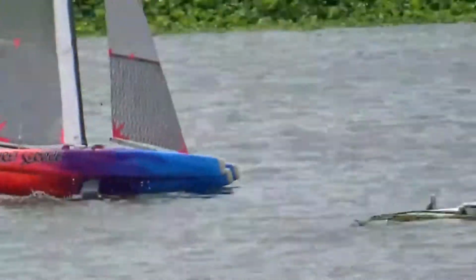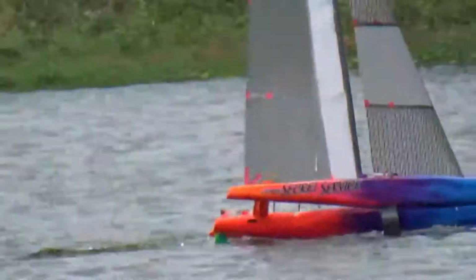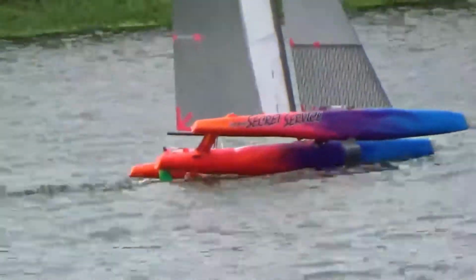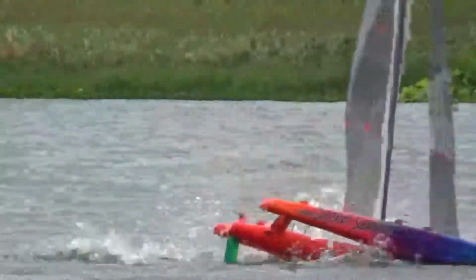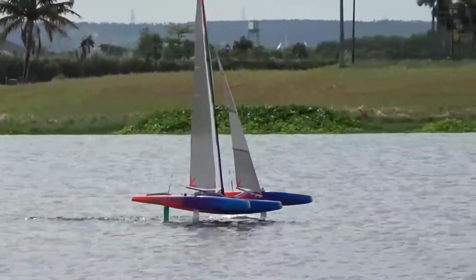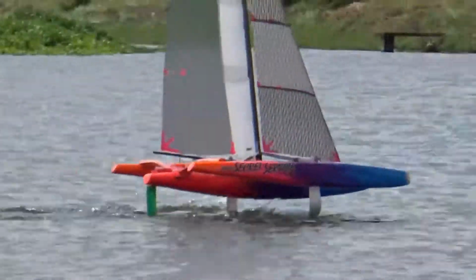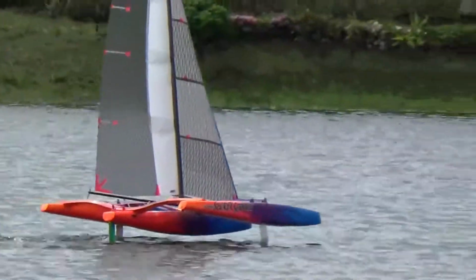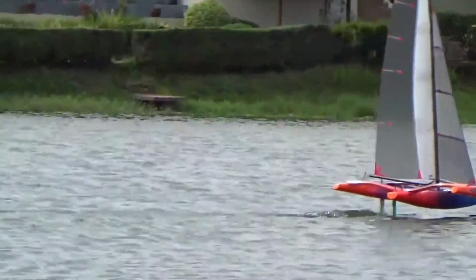There is a counter-argument against winglets, and that is that it can be good to let the boat skid sideways, as this can depower the boat and help prevent heeling. We're after the happy medium here, and we still have a lot of trials to undergo. The boat is certainly smooth going through the water with these foils, and had good directional stability. Perhaps I just need to reduce the area by about 10%, but I'm just guessing as usual.